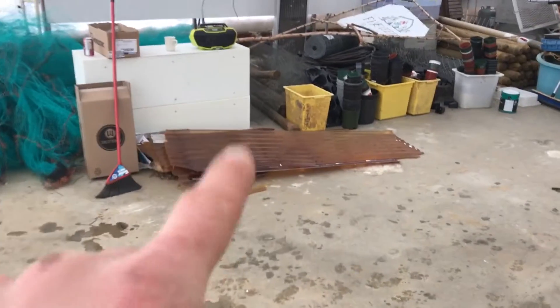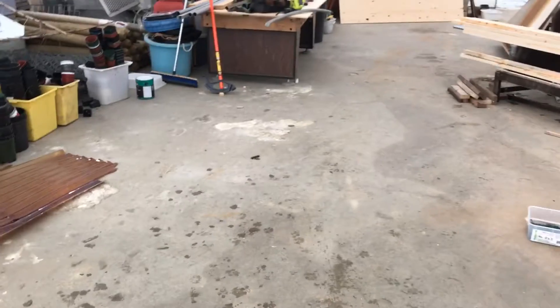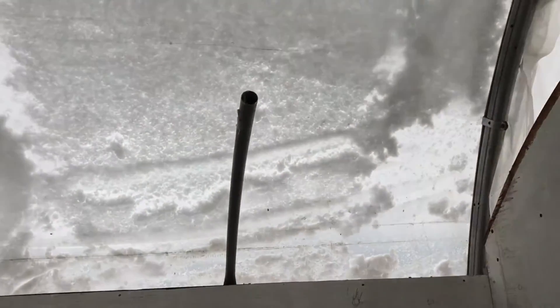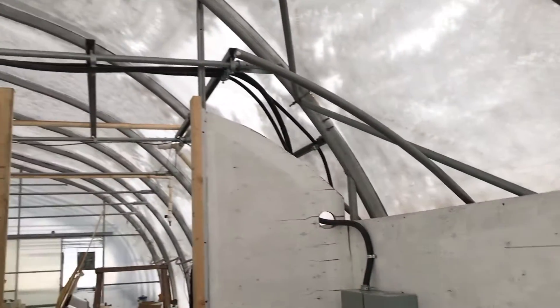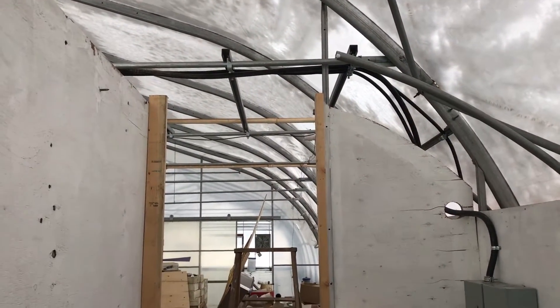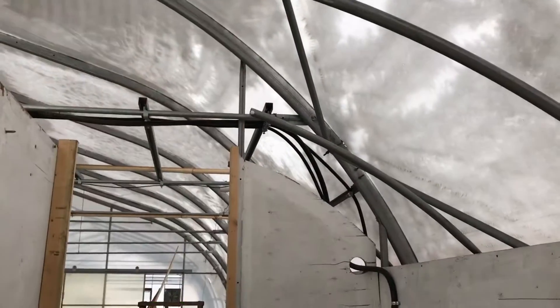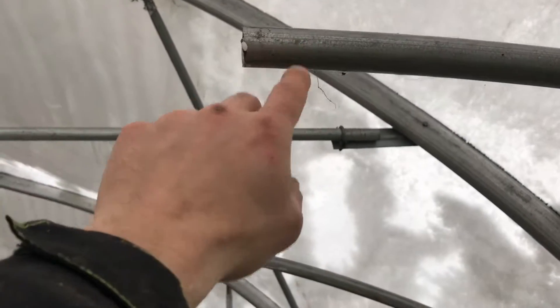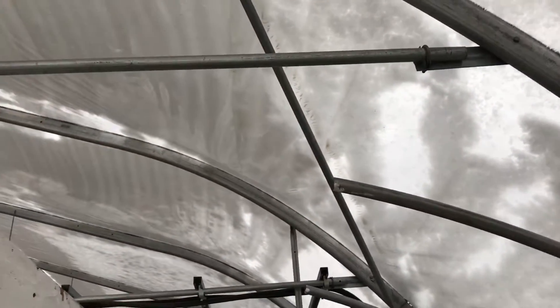An issue before was this clear covering over corrugated plastic on top, providing a roof in here to keep condensation off all the electrical stuff. Now that I've moved this wall out, I've still got to have a roof over top. I don't really feel like putting lights in here, so I'm going to use the same thing. But these pieces of EMT that provide the support are now too short, so I'll put some couplers on there, get another piece of EMT, bend it a little bit, and extend it to the end wall.